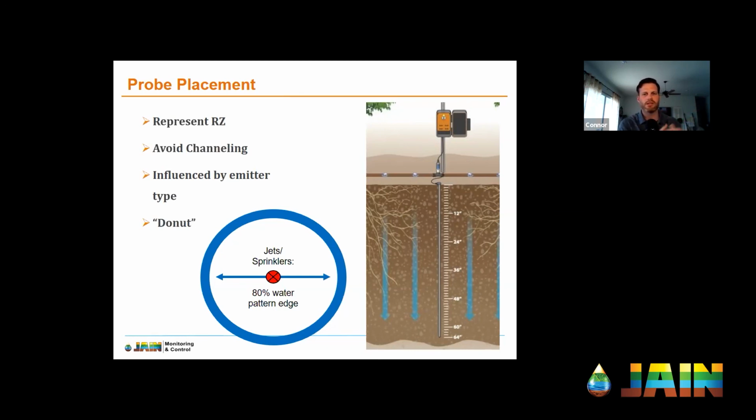You have to maintain the tensiometers. They're a little bit more brittle with the watermarks. They dissolve with time and they're not as accurate. And so even though you might be saving a little money there, you really don't get the value of the data that you have with one of these volumetric probes here, where you're having the multiple depths being monitored.